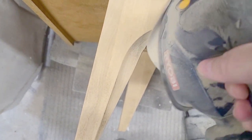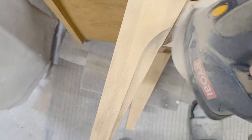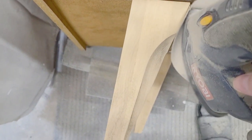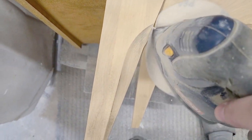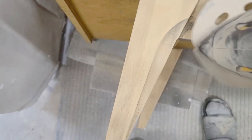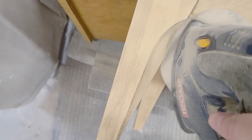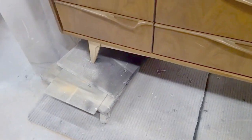I sanded down the legs and used my detail mouse sander just to get into the corners, because sometimes I can take the legs off and sand right through, but these legs were not able to come off. So I used my mouse sander to get those corners and the spots I couldn't get with my orbital sander. I used 60 grit on my orbital sander to take off the previous stain. I didn't have any mouse sanding pads, so I got a sanding disc and put that on the top point of the mouse sander, and it really did get off a lot of the stain.